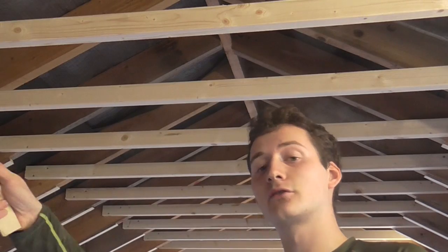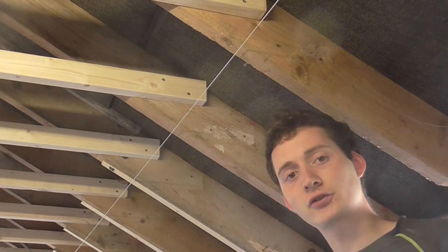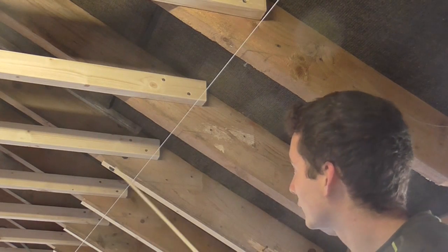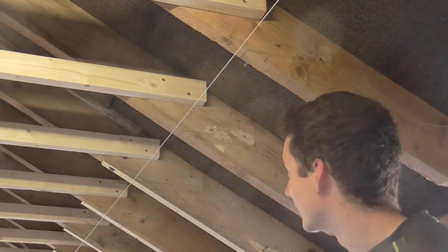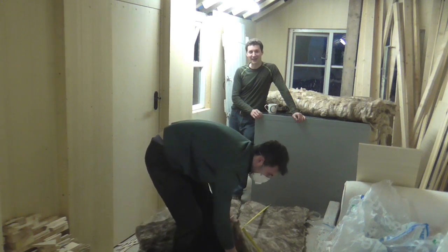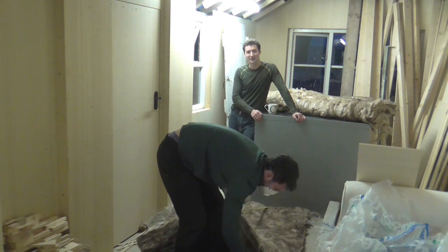On to insulating the ceiling now and I've removed all the lights temporarily. I'm going to do this in three parts: we've got a flat section across the top and then the two eaves down each side. At the moment they're all a bit out of line, so if I just screw the plywood board straight on I'll get a wavy surface and big gaps at the two joins. So to even them out I've put another chalk line up between the two high spots at the ends, measured the gap on each piece of wood, and cut a packer. I've got Ryan here helping me — he's cutting the insulation up and we're going to put it up in the ceiling shortly.